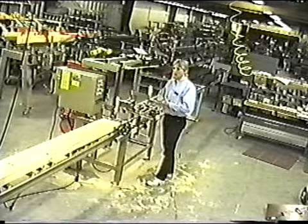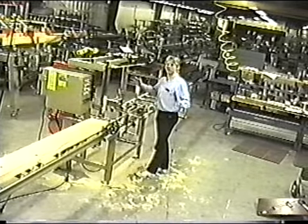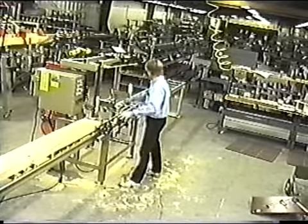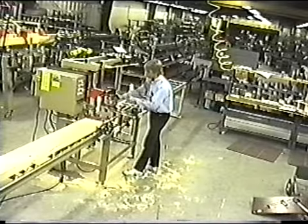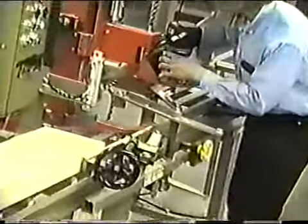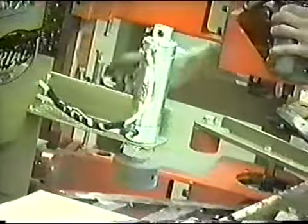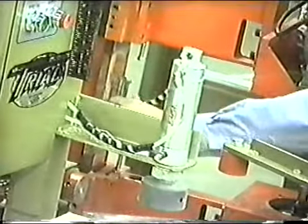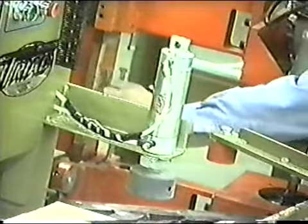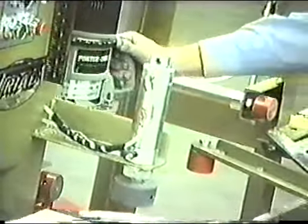Once again on template changes — you don't have to change the template as you're trying to get through the range. You don't have to change a template unless you're changing the material: if you're going to change your tread thickness or riser thickness, then you need a different template. Now I'm going to bring the arm in and show you. We're running with routers top and bottom. I have a turret stop — a rotating turret stop. The longer one is set up for two-by material, like we're running now. The next one is set up for five-quarter, and the next one is for three-quarter. Those are infinitely adjustable, because five-quarter isn't a worldwide standard — it varies across the nation.